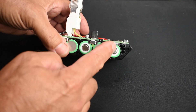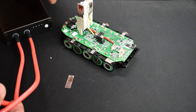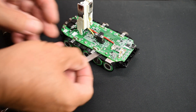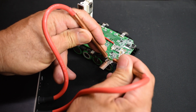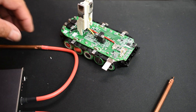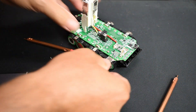What I want to do now is cut strips of tabbing to go between the terminal — the positive — it's going to come up over the top at a 90 degree angle and go straight close to the board. Turn on the spot welder, push and hold. This uses lithium polymer cells inside and is set to the highest setting — four red lights. Hold one side down, push hard, then the other side. You want at least four connection points because there is going to be a fair amount of current going through. This one has six connection points.